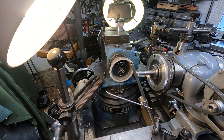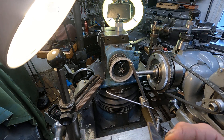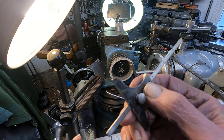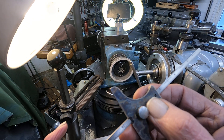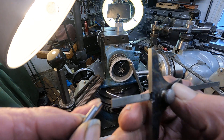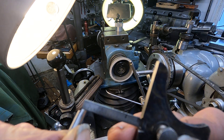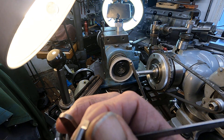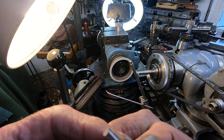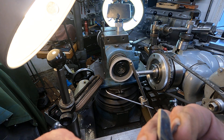This is the prototype cutter that was brought to me. It's got an angle here of about 22 degrees, and this is just a bit below center to make a D cutter out of it. Here's the undercut for clearance, and if you can see it, it's got a little cut along that edge there that gives it a nice chisel edge. You can see it right there catching the light.